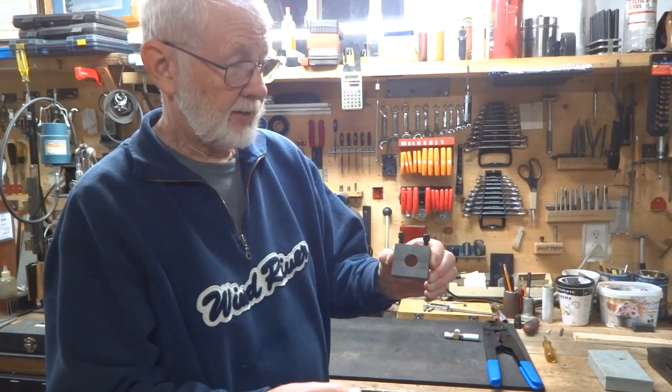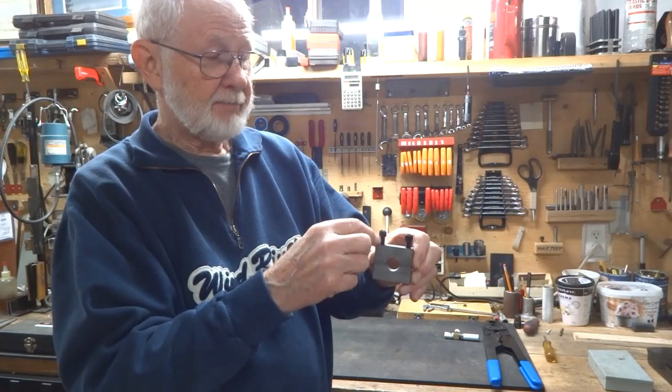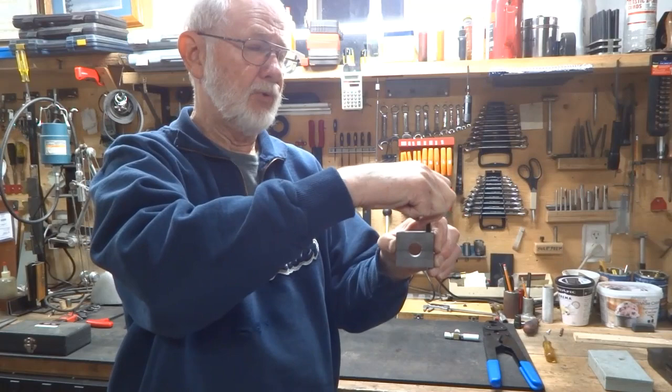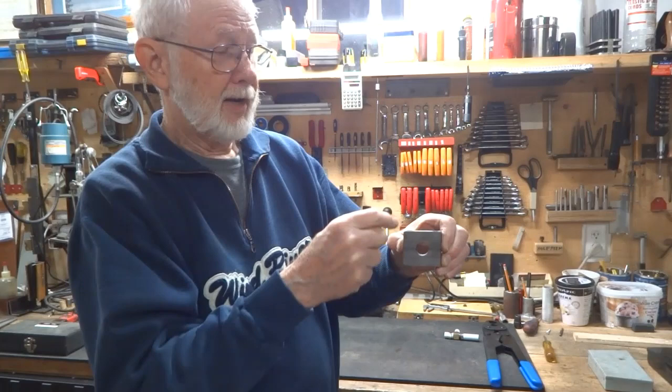This is about two inches across and about two inches deep, made out of half-inch material. The way I started was to put tapped holes — you could put them all the way through if you like. I chose not to; I went almost all the way through using a five-sixteenths eighteen thread. So these are five-sixteenths eighteen threaded bolts, and I ran my tap drill through about 300 thou in from each side.